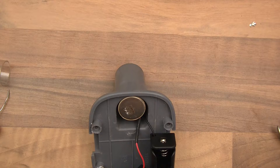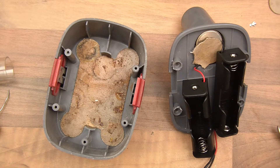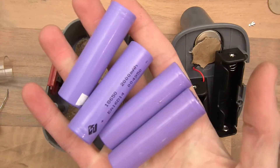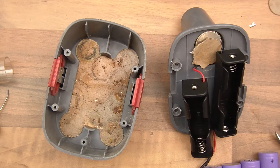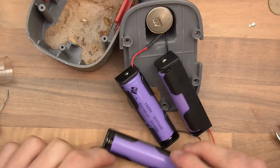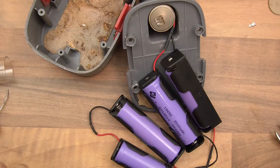Get a bit more of this card. I think these cells are dead anyway, but I'll just put some on there just in case. Now I'll need to get some cells of course — I'll just go and find some fully charged ones. I've found these — they're all 4.05 volts, and they all seem to be out of the same batch, although I'm not 100% certain of that. So we've got all 4 cells in here — that's 4, 8, 16 volts. So this is rated at 14.4V but I'm going to make it 16 volts.